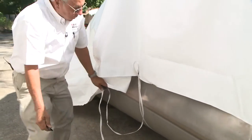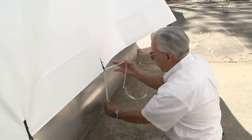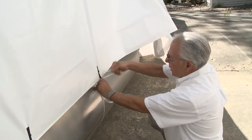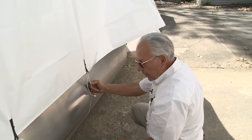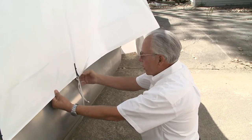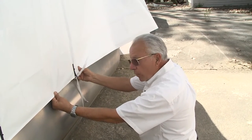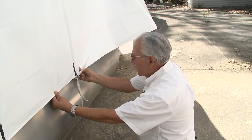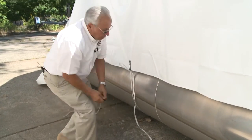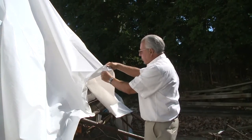Put these clips about every two feet. We recommend using flat strapping to tie the cover down — it's good for all kinds of tying and bracing, and it does not stretch. Once you tie it down tight it stays tight. After the cover's been on for about a week it may relax a little — just adjust them so they're all snug and tight. Keep the cover down tight on the frame; if the cover starts moving on the frame, that's when they self-destruct.